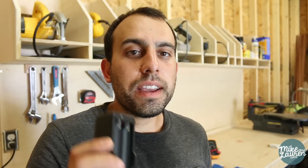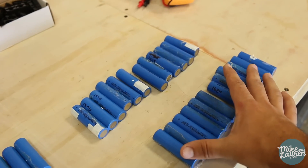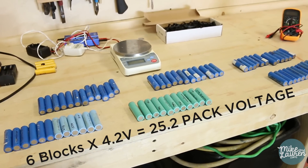There's an easy way and a hard way to do this, and I chose the hard way. The easy way is to order cheap two-dollar 18650 chargers off eBay, charge all your batteries, use the IMAX B6 to discharge every battery, then charge them back up. I did it the slow way — charging, discharging, and recharging every individual battery with the IMAX B6 while waiting three to four weeks for the connectors from China. Since my electric bike has a 24-volt motor, I'm going to wire each group of 12 in parallel, then wire the six blocks in series to hit 24 volts.